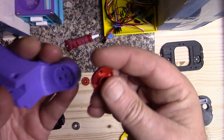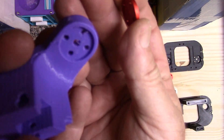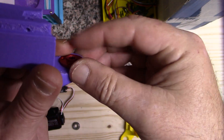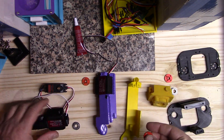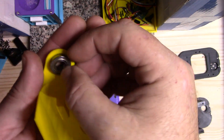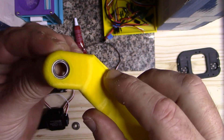Two things to note: the bearing holes can be slightly off-round due to 3D printing. If that's the case, drag a knife around the oval part to clean it up. If it still doesn't fit, don't force it — heat up your soldering iron and it'll sink right into the designed slot. One bearing goes here, one here, and the third here. The bearing just slips right in and normally snaps in place; your printer may leave small plastic zits to clean out first.